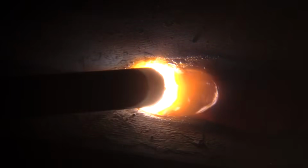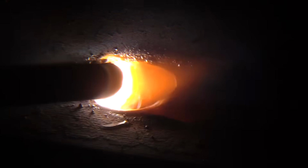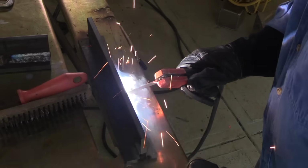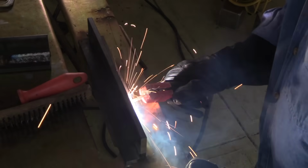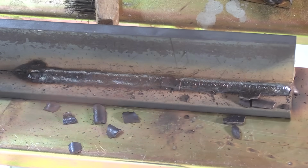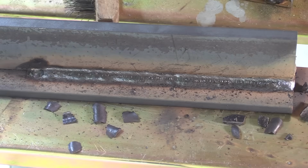I did not clean any of the mill scale off for this particular little skill exercise. It is best practice. It will weld a little bit better, but for the sake of training, I just think it's wise to just spend your time welding. When you get on groove welds and bend tests and things like that, definitely clean the mill scale.